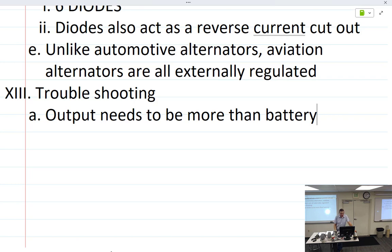All right, so radio suppression is different. Possibly true. I would imagine that our alternators for aircraft have better filter systems for radio noise suppression in them, a couple more capacitors. Belts and pulleys are different. Yeah, they're different in cars too, I've noticed. Brushes have a different compound to prevent corrosion, higher graphite content and tin plating on leads. Again, not my words. The stator is definitely delta wound in aviation ones, according to this. These have a shorter drive shaft and different size threads. I don't know about that. Anyway, that's what they said.